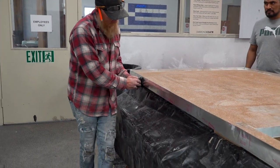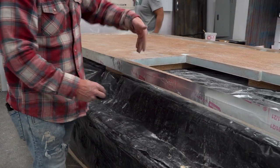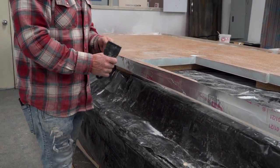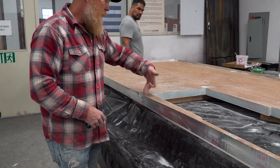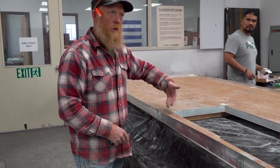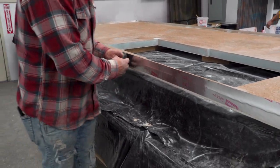Watch your wrinkles too — the wrinkles will really let epoxy seep down through them. So if you have a wrinkle in your tape from putting it on crooked, it'll just slowly seep epoxy and pretty soon you'll have a real low spot right there in one corner, a couple four or five inches. Just make sure it's really pressed in.